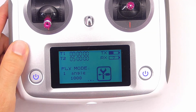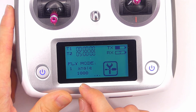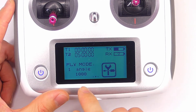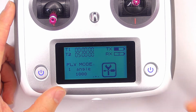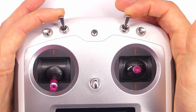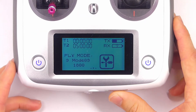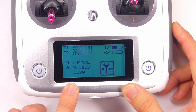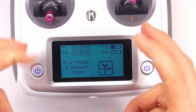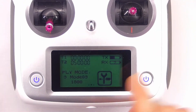When you're done you just go back to the main screen. Now in the main screen fly mode shows position one — 'angle mode' in our imaginary situation — and if I flip both switches all the way down, which we set to 1800 microseconds, you can see it says 1800 microseconds, and this is also mode 9, the ninth position by default for this combination of switches.